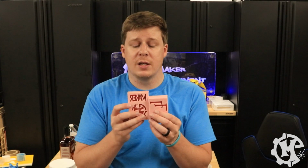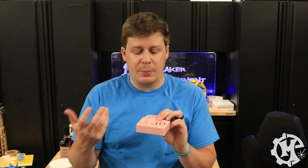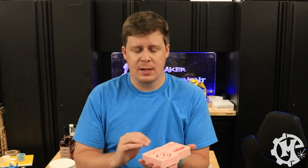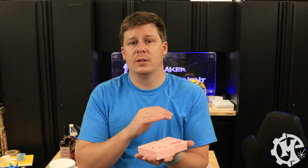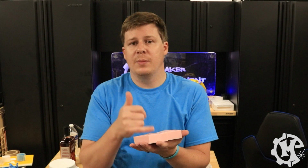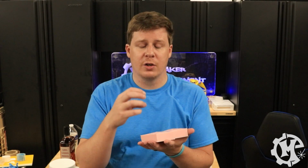Now the logos and the designs with all of the text and the pieces on the inside, a couple of things I think I would change. So one is if I kept the design as is with as much complexity as it has, what I think I would do is actually put 2 layers or 1/2 inch of the design itself, and then maybe the last 1/4 inch as just a backer that's completely flat and solid. I think that would give it a nice base that it could work with. Yes, it would take away from the see-through details, but it would be robust enough that I think it would survive.